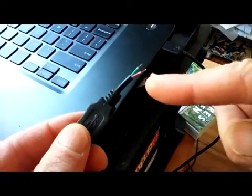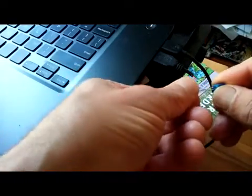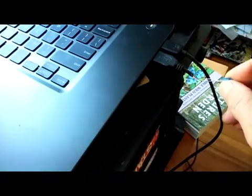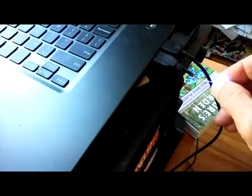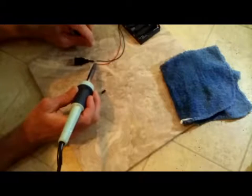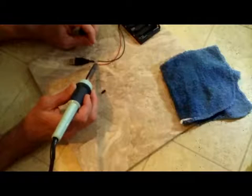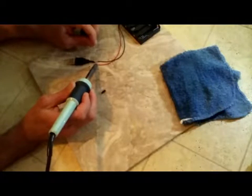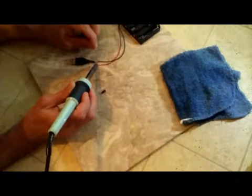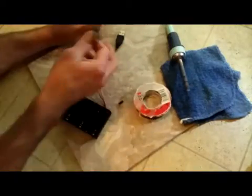Having snipped this, I think the red lead is probably positive, but I'm not totally sure. It's got a green lead there as well, and I'm going to take care not to touch the wires as I do this. Sure enough, that red lead is positive. Those of you who solder know that you heat up the part of metal you're going to solder, not the solder itself. Let's get that nice and hot and apply a bead of solder right in there. I'll wrap those leads with electrical tape.